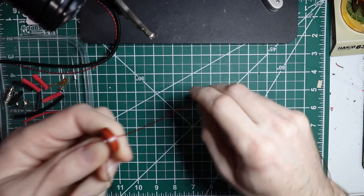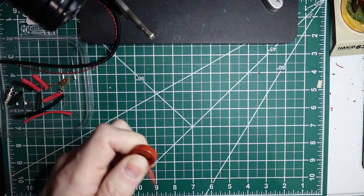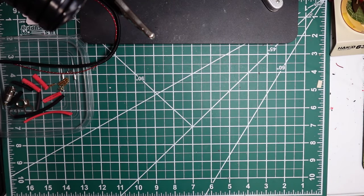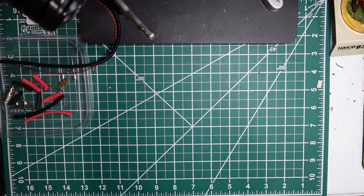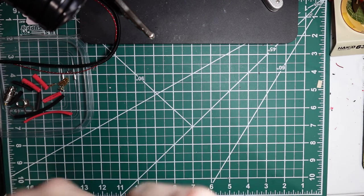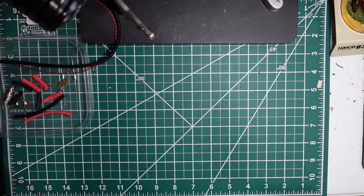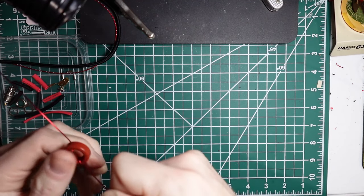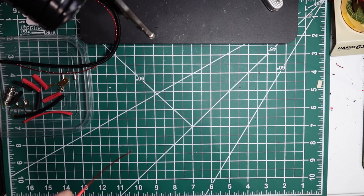But what we have here is a T80-2, so 0.8 inches outside diameter, and a mix of two, so ferrite number two mix. And what I found is the absolute best efficiency on this winding is a trifilar 12 turn. So we're going to do a 12 turn, which, as it turns out, 12 turns is exactly what fits on this T80 with this gauge wire I'm using,